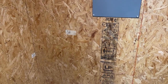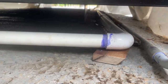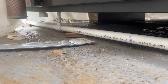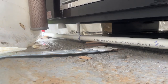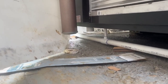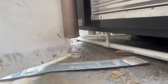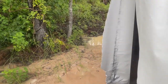Coming outside again — the final electrical I think I already showed you. And then the final plumbing: we run down underneath the edge of the kiln, then it turns and goes across the back here. That little half-inch sticking up is the water supply into the kiln. That two-inch line just to the left of the half-inch is the drain off the vacuum pump. And there's another two-inch line just past it — that's the vessel drain. That big muffler there is exactly what it is — a muffler. When that vacuum pump is running it's kind of noisy, so we've got a big muffler.